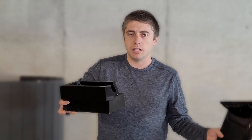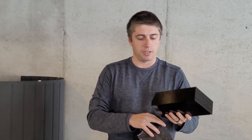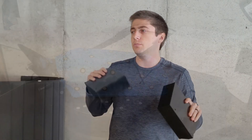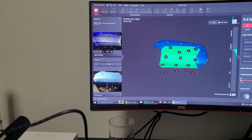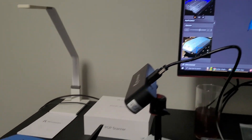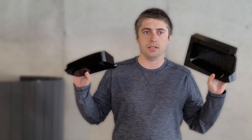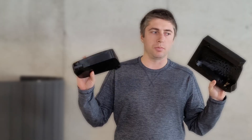So how far can it go? This is a compression mold — specifically a compression mold for mirror covers. I don't need to make these parts, it's literally just a thought I had and something I wanted to try. It's actually two pieces: an outside and an inside, or you could say a female part and a male part of the mold. It has little alignment pins and it sits together with a defined gap.